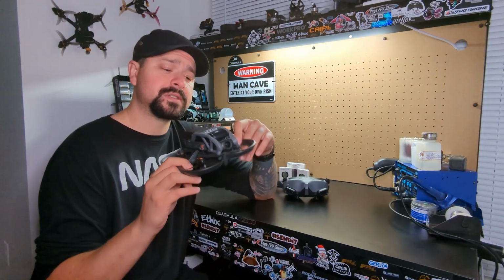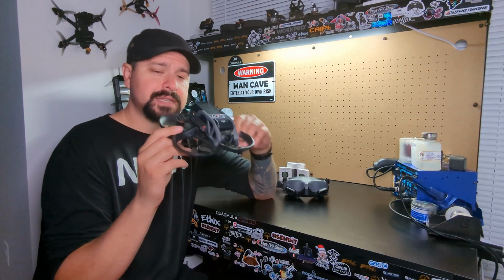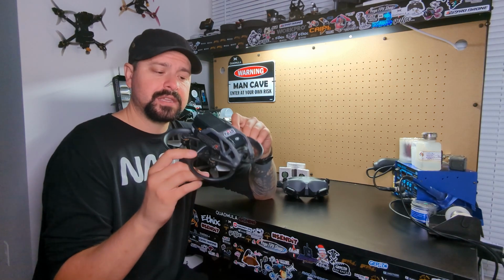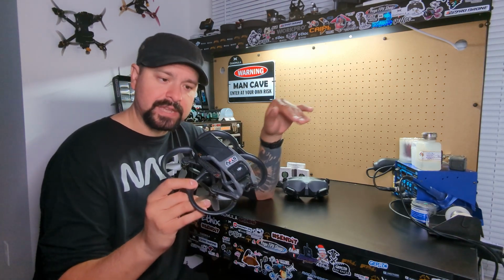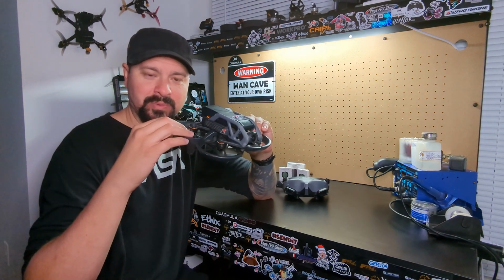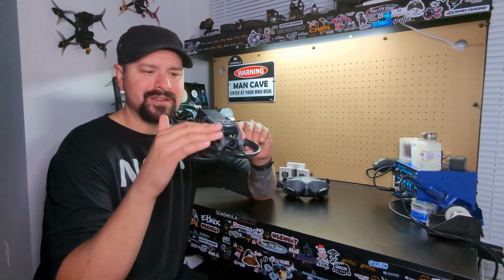Another thing that you may have noticed in the video is the fact that I actually did perform a pretty sharp yaw, and it did have that situation where it has low yaw authority and low stability. These motors do not completely alleviate the fact that this is still a ducted drone, which has reduced airflow to the propellers, and the fact that its design is kind of made in a way that's not incredibly aerodynamic.